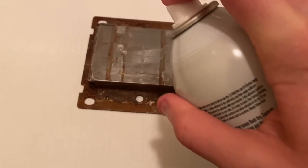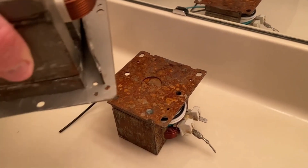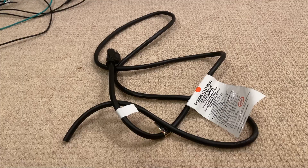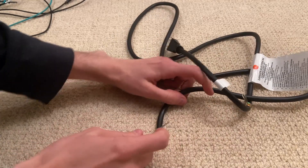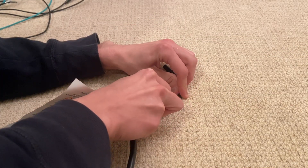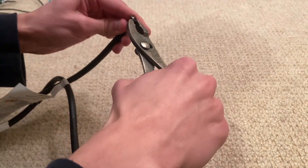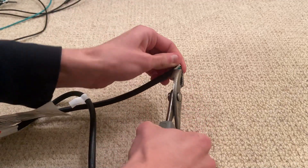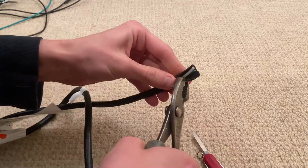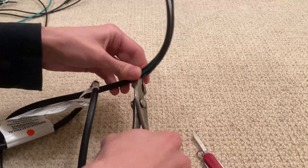Here I'm wrapping the windings to increase the amperage, then we have to spray some adhesive on to reattach those things. A nice heavy weight is great for allowing that to cure. Now for the wiring, which will actually plug into the wall — which is a horrifying thought. I have this long extension cord; I'm just cutting down the length of it to expose the three wires: the grounding wire and the two power leads, which are definitely going to be repurposed for other uses in much of the machine.